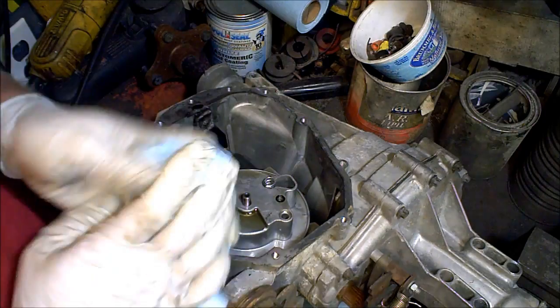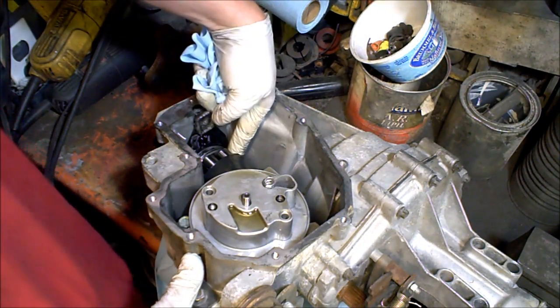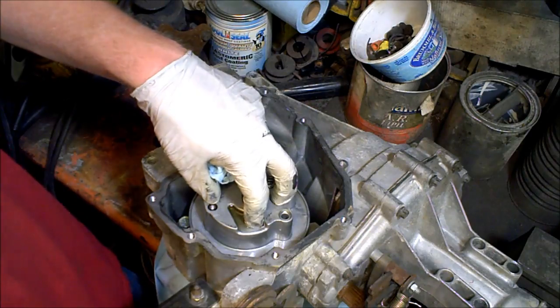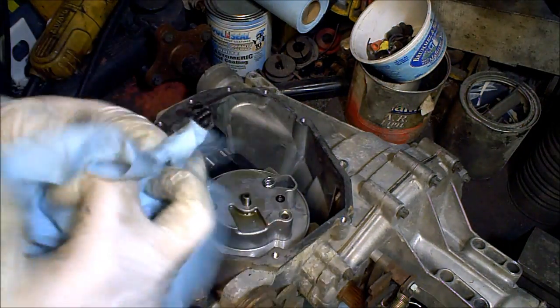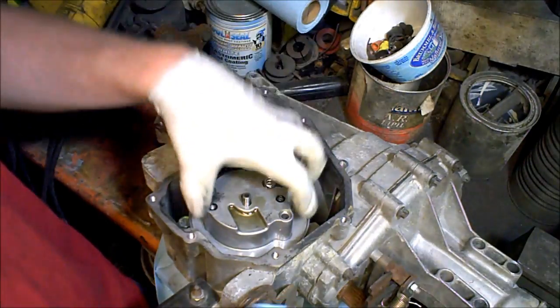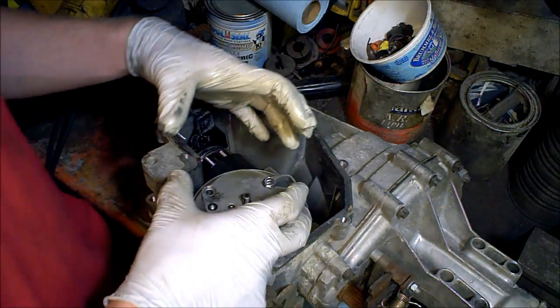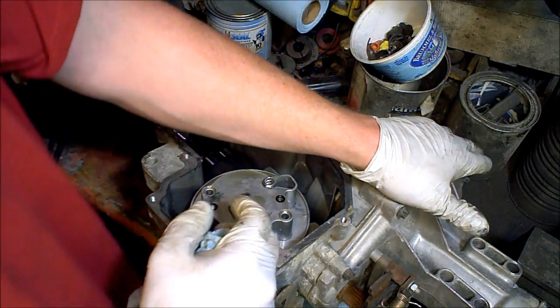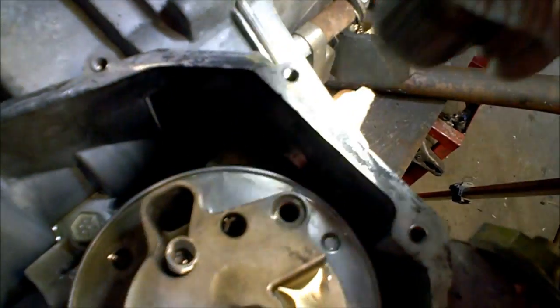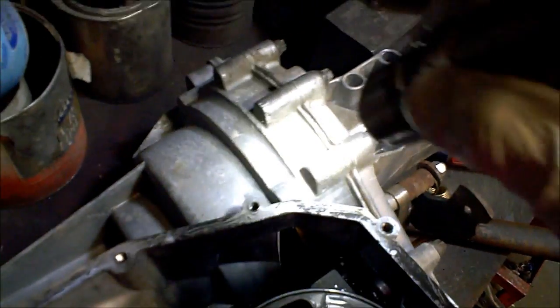Basically there are two parts. This right here is your motor — your pump is under here. So your engine turns the input shaft, which is directly under here, and that is what your motor turns. Through hydraulic pressure and through this main block it turns the output. This is the main part of your transmission. The back here is essentially your differential — you can see the differential gear right there, and that really small gear, which is actually connected directly to your brake, is what your motor's turning. It's turning that at very high speed and in turn gears it down to your wheels.